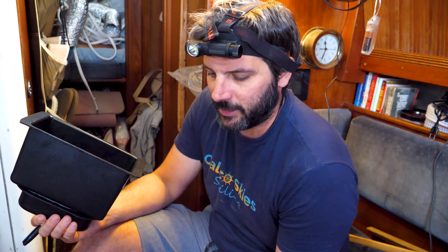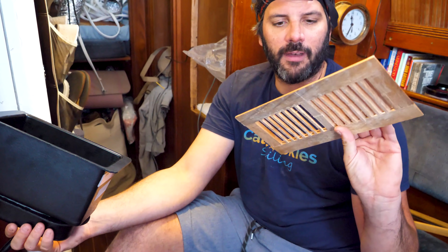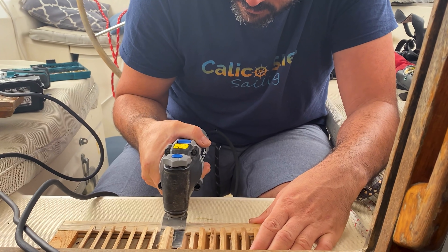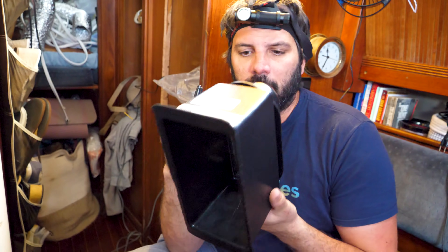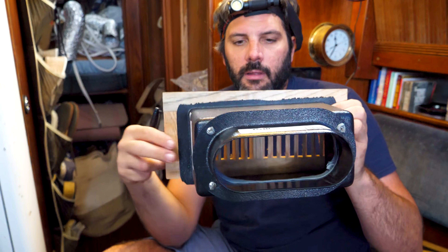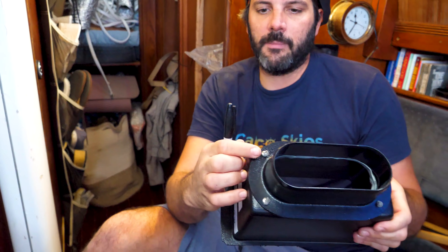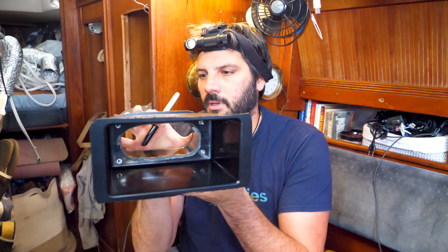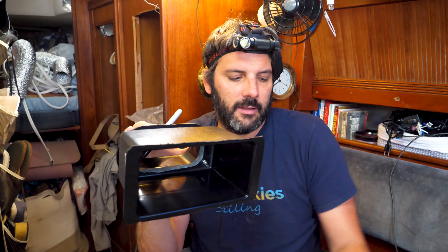I think I finally have our ducting under control. I was too cheap to buy a marine one of these, so I bought a seventeen-dollar one off Amazon. I had to remove the wood with a Dremel and chop it down because I couldn't find the right-size transition box. This basically makes air distribution more efficient. I took a jigsaw and made it shorter, and I had to cut a hole in the bottom and add an oval duct so the hose could attach. I put butyl tape in it — if it stops water, it should stop air. We're going to drill a hole where our speakers used to be, the box will be against the bulkhead, and the hose will come from the unit through here into the closet.